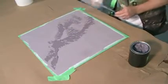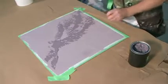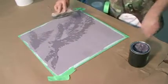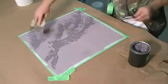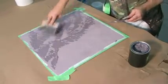Here we have selected to do a directional skip trowel, which is applied in a generous thickness, allowing for pattern control. Then, when a desired pattern is achieved, the excess material is removed using the push trowel stroke method seen in the smooth rock finish.